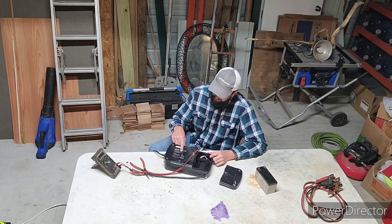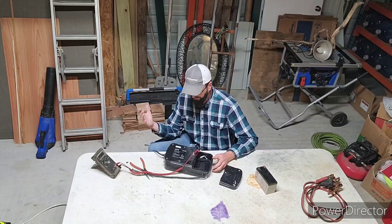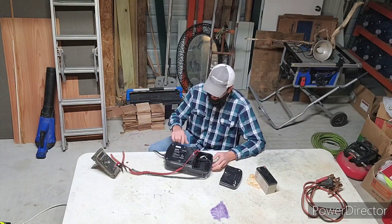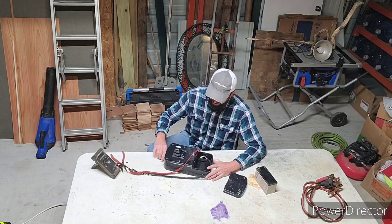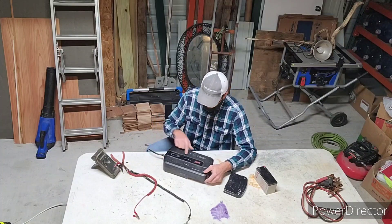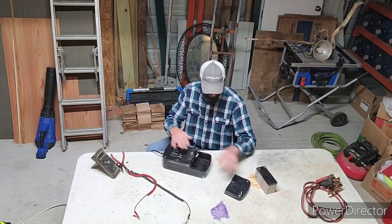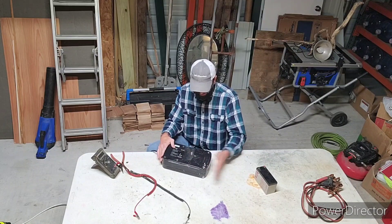The only limiting thing about them is the output on the inverter built in — they're usually kind of small. I think I've got one that's 1500 VA, so it's actually only like 860 watts because they go by VA — that's the bigger number they put on the label. It says 650 VA, 390 watts — so that's what they advertise. Anyway, this is what you do: get the jumper cables, hook them up, and I'll do that to this one too eventually. But I've already got one that I did — I'll show you.